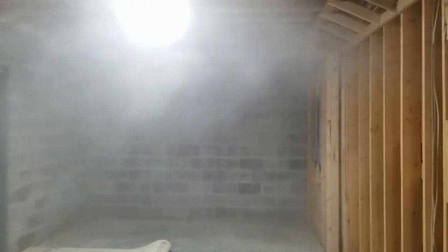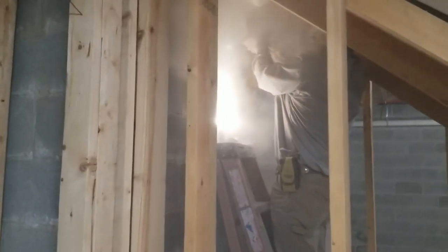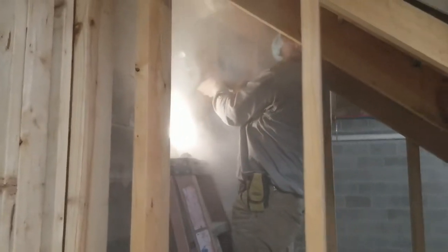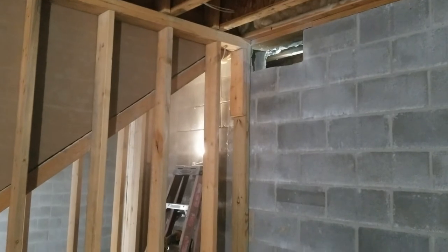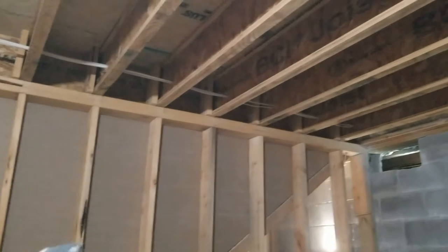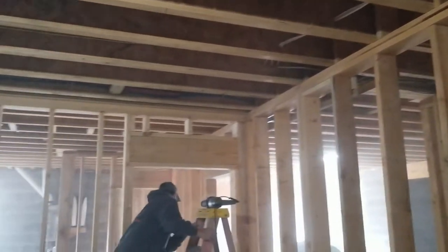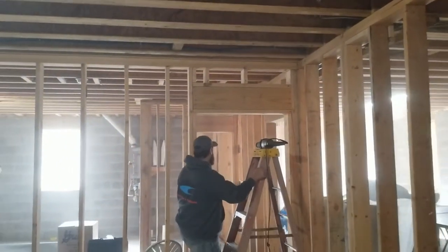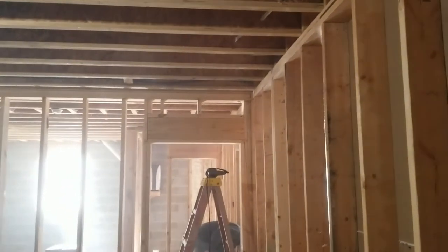Making a little bit of a mess down here, moving the furniture out of the way. So this is where our supply is going to come through — we keep it nice, high and tight, have all of our takeoffs or branch lines up in the bay and they're going to sheetrock it, so we want to have as little box out as possible. We'll go above that door and feed branches and go both directions with our branch lines.